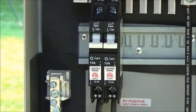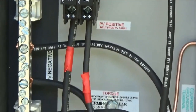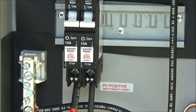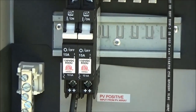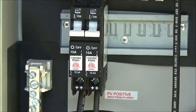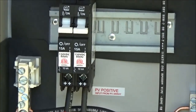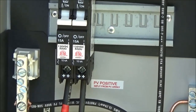The other six days we wanted to use the breaker on the right. We're going to charge a battery bank in the basement of the home and run a 24-volt system off of this array. You can run them simultaneously, but there's a problem: when the charge controller does its sweep to check on the power coming in, it ends up interrupting and establishing a new voltage level, which shuts the Grundfos down and the pump has to recalibrate.